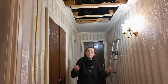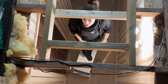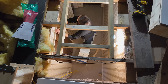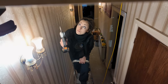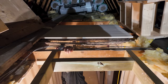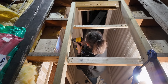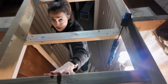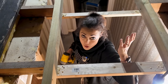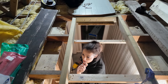We need to prop it up on some wood so the frame's outer edge is in line with the existing joists - I'm using any straight offcuts I could find. I've got enough props there. Now we need to get the frame up and screw it all into the joists at 27 and a half. I'm screwing this end first since the OSB isn't the strongest. I've now got screws through the framework into each joist on both sides, but rather than too many screws now, we need to check that the loft ladder kit actually fits.